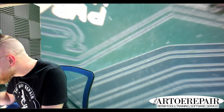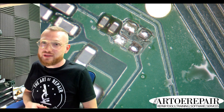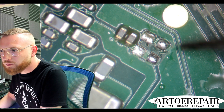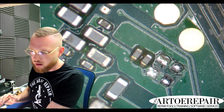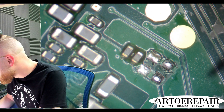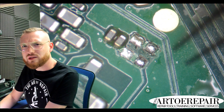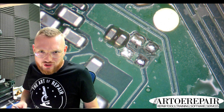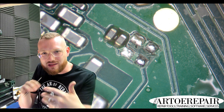I have prepped this board with two different solder alloys. If you've been watching this channel, you know I put 63/37 on this board. Looking right here, we've got four different joints — both pairs share a single trace pathway on both sides equally, because we're running a little experiment and need some control. I re-alloyed one side to 63/37 and it looks different — one is darker, one is lighter. That's because one is just what comes with the board: lead-free ROHS, melting around 217°C-ish. I say ish because it has a plastic range — it's kind of like lava, kind of liquid and kind of solid at the same time, it doesn't all transition at once. Whereas the 63/37 has a melting point of exactly 183°C — that's a point, not a range. As soon as it hits that temperature, it goes liquid. It's a great starting mark — the gun goes off and you've got to run.